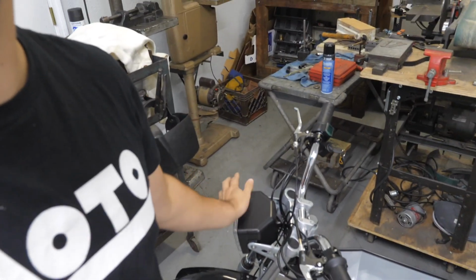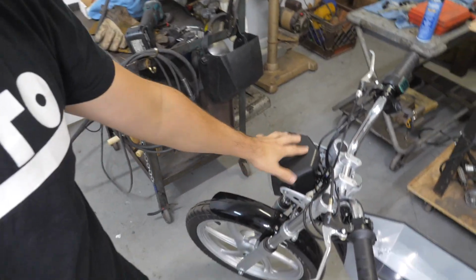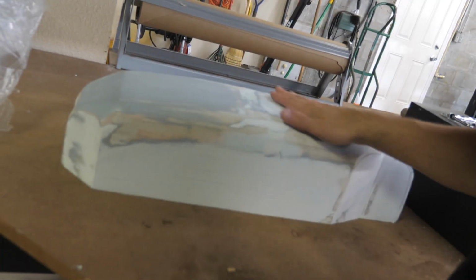Previously, we did a halogen bulb. The halogen bulbs are bright, but they got hot, and in the headlight, we have a little wiring block that sort of marries all of the control stuff together. That heat's not great for the wiring blocks. LED's way cooler, but these LEDs are super bright. It's not a downgrade, it's an upgrade, if anything. Just a little extra money to implement, but it's worth it.